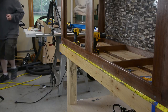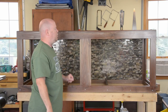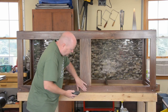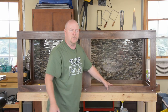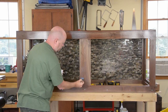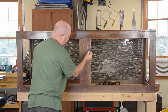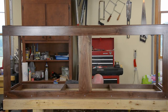I'm doing my final 400 grit knockdown sanding before the last coat of semi-gloss and then the wax. This is also an opportunity to touch up any blowout from drilling the screw holes and find any screws that need a little more depth with the countersink. The final finish is the last coat of semi-gloss, which knocks the sheen down just a little bit more. I'm being pretty careful to put this on with the direction of the grain so it looks as good as possible.